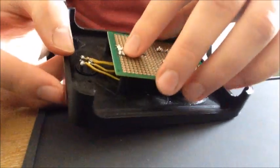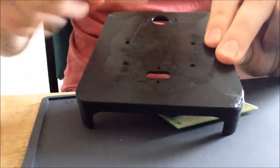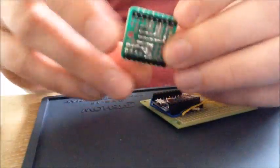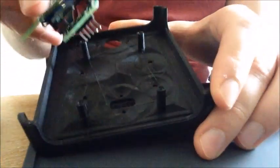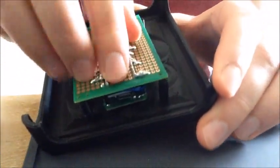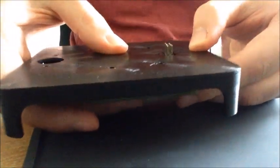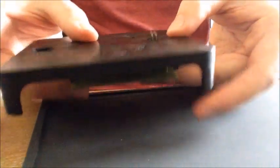That all mounts up really nicely and fits in place rather well. In the back of the dinosaur stand there's a hole, and I've created a little extra circuit board — a tiny one — which I've soldered up and slots on top of the Arduino like this. Once I've got that and put it back in its place, not only does it connect to the bottom but these bits slot through and screw into place, flush with the bottom of the stand. Then I can just plug the wires in for the dinosaur's servos and for his eyes — the LEDs — right into there. How nice is that?